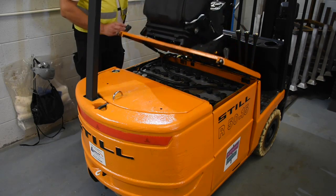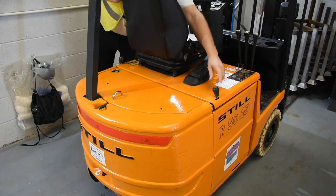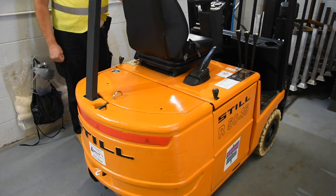Lowering the lid down on our particular truck: one side stays live, pull that handle back, slot the handle, and it is now safe to mount the truck and move it to a position where we can continue with the rest of the safety checks.